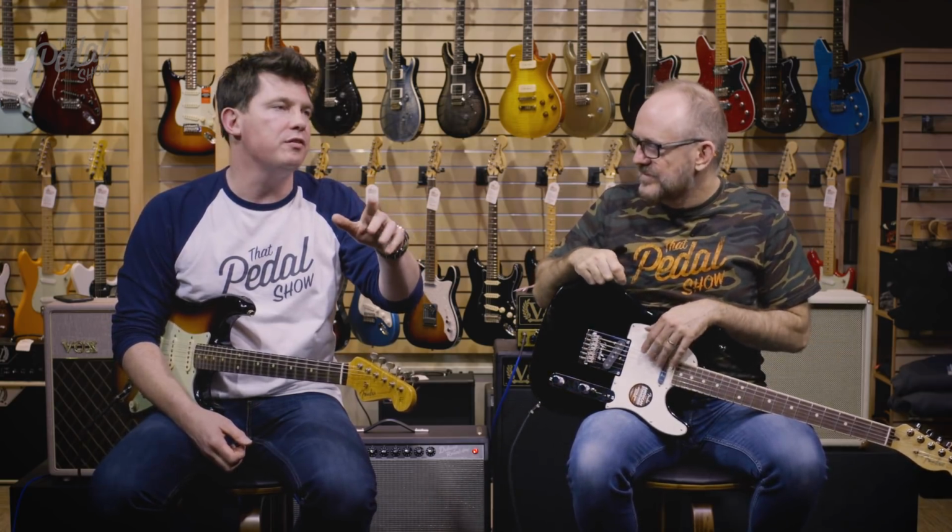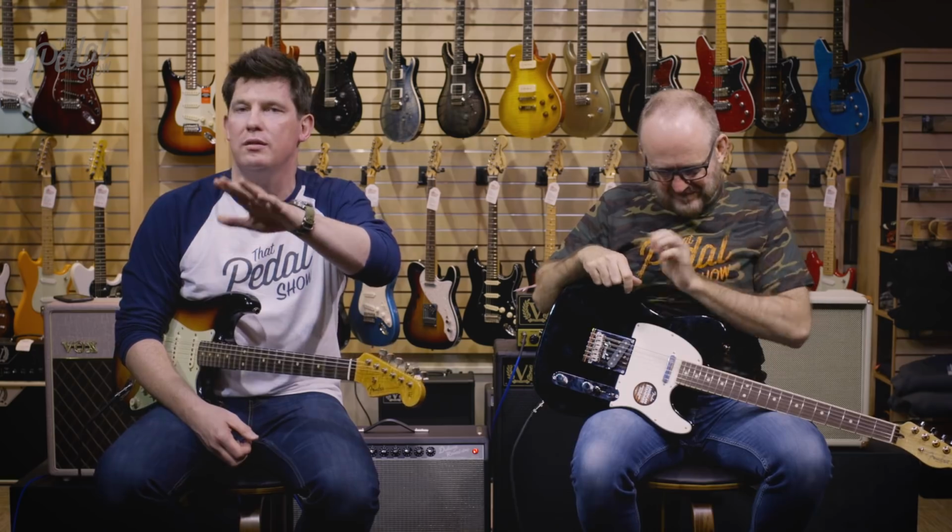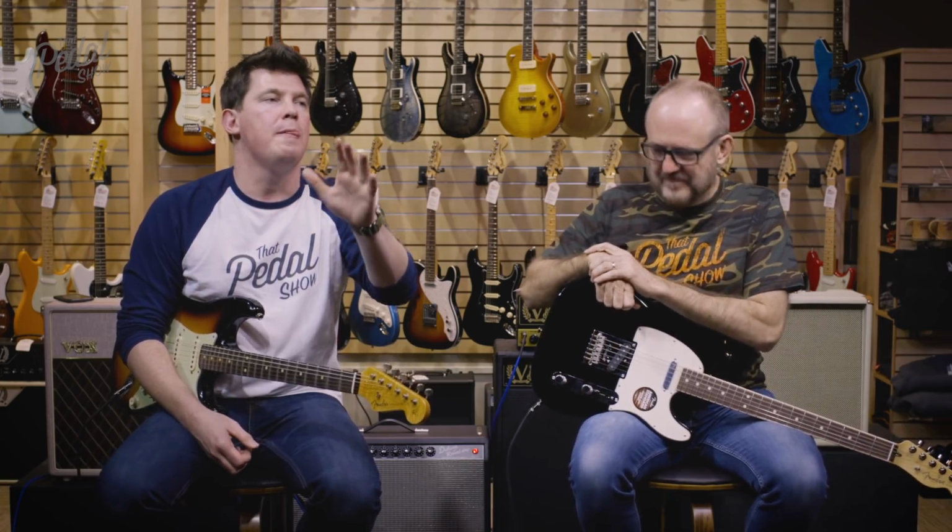Just for the benefit of the video, because we don't have a mic with the audience. What's your name, sir? Tim. Tim was saying that he has a 4-input Marshall. If anyone's familiar with jumping the channels of a 4-input Marshall, if you look at any pictures of Hendrix, 4 inputs on the front, he'll be plugged into one with a short patch cable between two of the other inputs. It links the two channels on a 4-input Marshall up. And you're saying that you run effects in that link? And then with it being the bass channel, everything's that little bit darker.